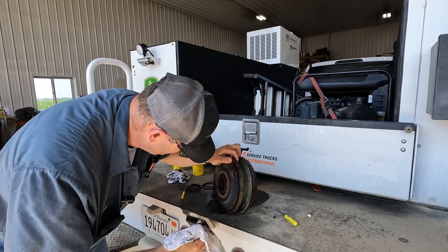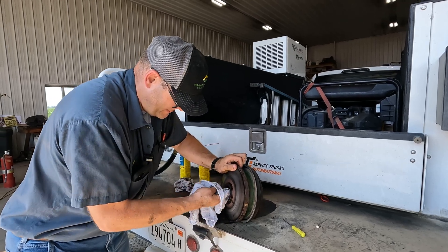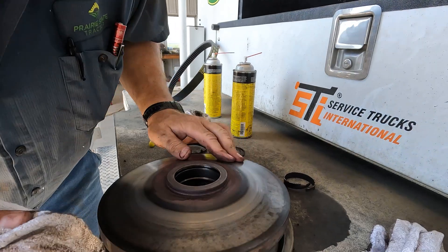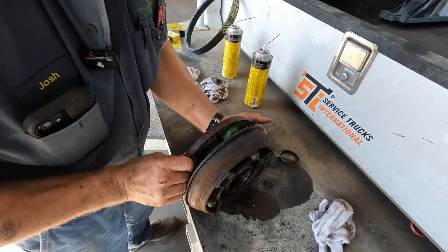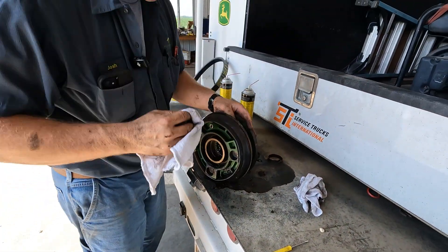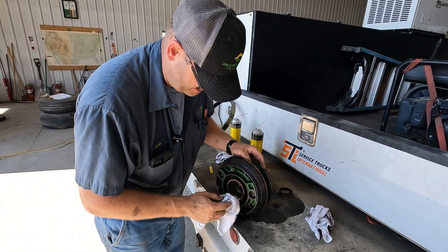The same synthetic grease we use in the combine reversers and the shivs, which is supposed to help. But this is pretty hard, pretty nasty stuff. Once we get everything cleaned up, there's a bearing inside here - check it, it feels nice and smooth. Get this contact cleaner out of here - it'll evaporate anyway, especially on a day like today.